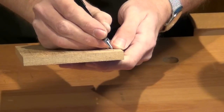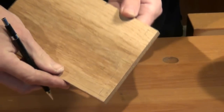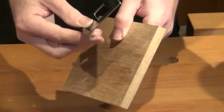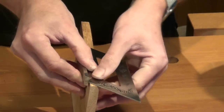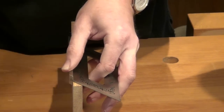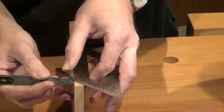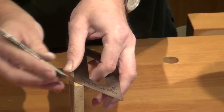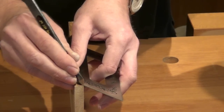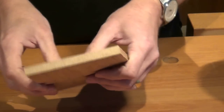I'll just highlight the gauge line in a few places with pencil so you can see where it is. Since I've got a mitre square, I will check and knife a line across the far end — that will help to avoid any tearout. And it matches the outside corner precisely, which is what we worked out it would do. Knife that in and now we're ready to plane it, so let's take it to the vise.